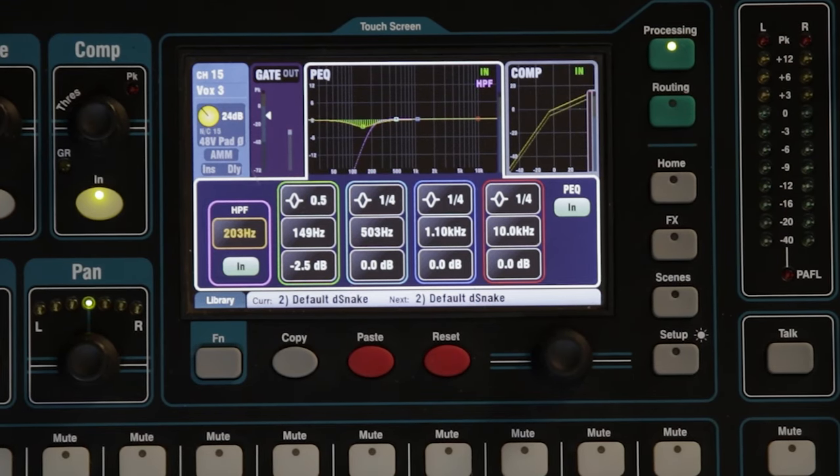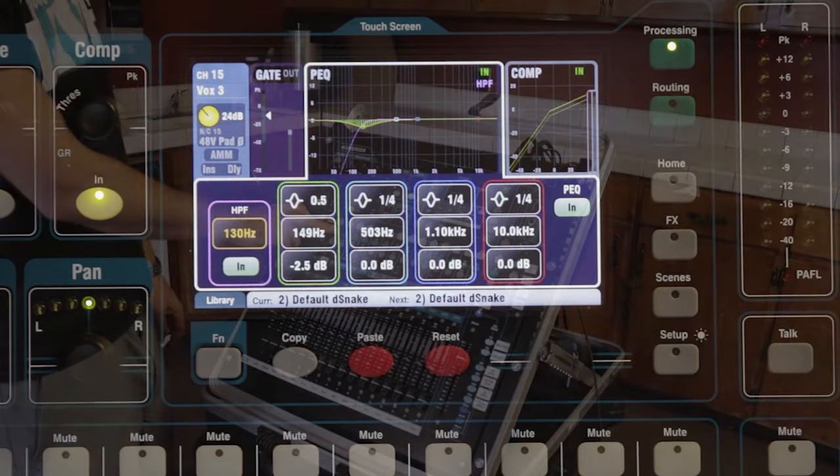That I find especially useful in a speaking situation where somebody may not have the best microphone technique and you're really trying to fight with feedback. So you want to really narrow that frequency range that you're reproducing. You can push that all the way up to like 250. That way you don't have to worry about any low frequencies feeding back, and then you just have to cut around with the high ones to find where it does feed back.